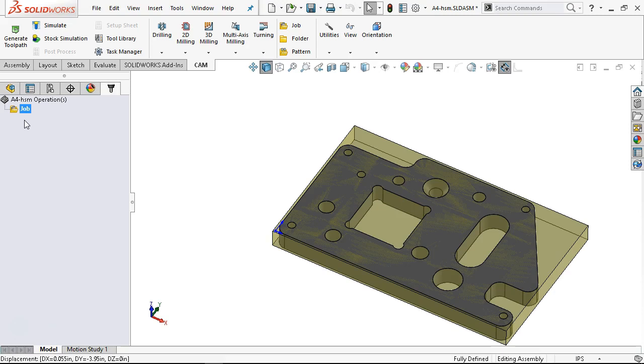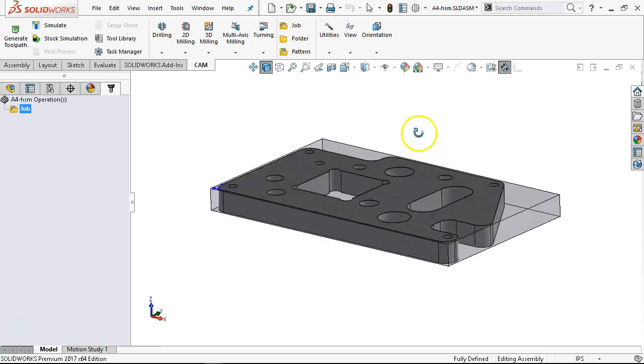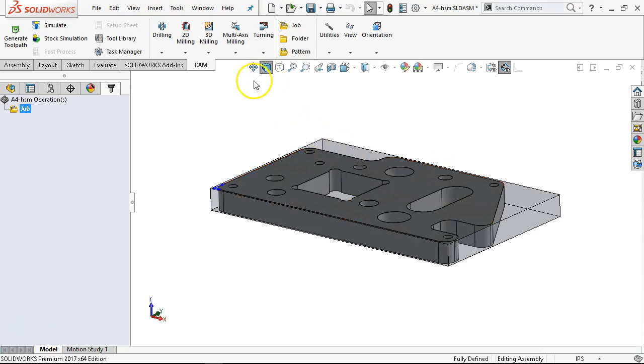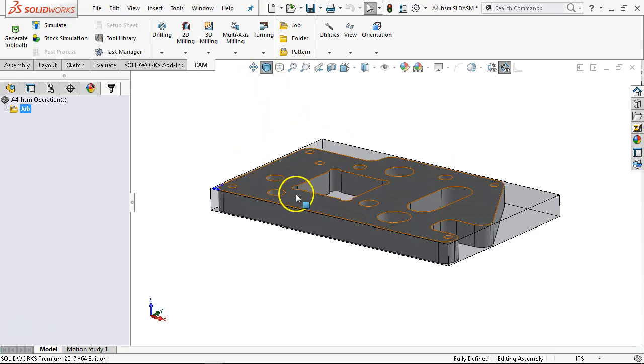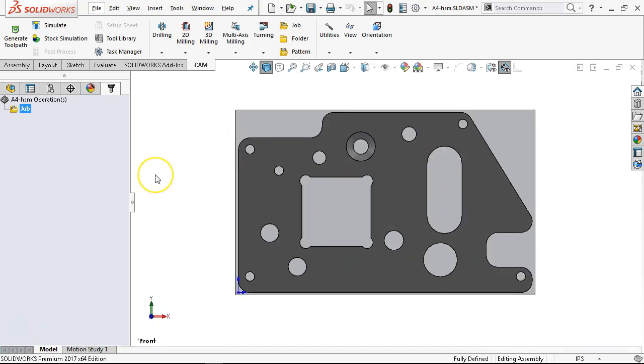I have my position. The decision is: if I'm clamping here and here and maybe along this edge, I can get all of the drill operations in — but I'm maneuvering around clamps. I don't really want to be flying around a hundred thousandths above this part. I may not want to be five inches in the air, but I want to be able to clear the screw heads, the clamps, and any obstacles. That's going to guide my decisions on the clearance planes and heights.